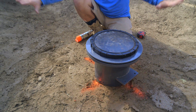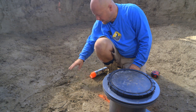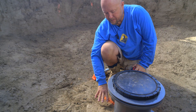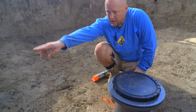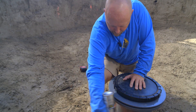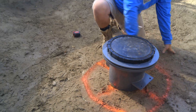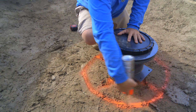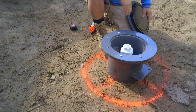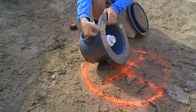The bottom of the pond is coned. If I took a level and went back, this is about where we're at in the middle to give you some perspective. It's about 12 inches - we're 12 inches deeper in the center of the pond floor than where the walls are connecting. So the next step is for us to dig this down, because right here is where our liner's going to attach. So the pond's floor needs to line up with right here.